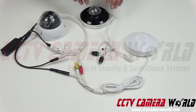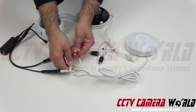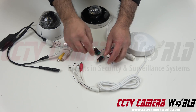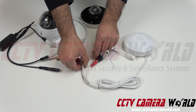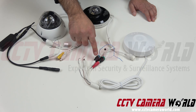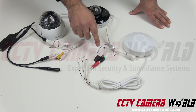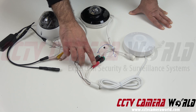Now let's compare how to connect a camera that has the two lead wire terminations — it's a little bit different. I'm going to disconnect my two-way audio box. On here, white is the audio in, so the red connection from the mic and speaker goes into there. The other one goes into the audio out, which is the speaker connecting into the audio out on the camera — that's the red wire. These two little extra wires you don't even need — you can cut them off. All you need is one little strand of wire. So now I've connected the audio connections.